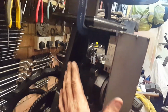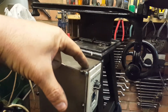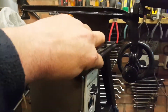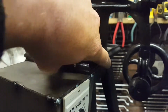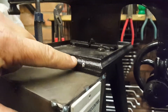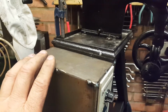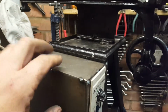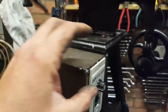Following what we need to do at the rear and the mounting of the brackets, I'm then going to continue this profile here, along here, of this table. I'm going to put a piece of flat stock in here, and then we're going to try and get this radius here. I'm going to use some round bar, weld that to the flat stock, and then just sand the flat on it. Try and get this all the way along to make it look like it's one piece all the way around here, for an additional tray for, well, just for the look of it really, and I don't know, spanners for the blade or spare blades or what have you. But that's going to go on here. Might make a little rubber mat in the end, I don't know.